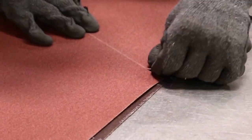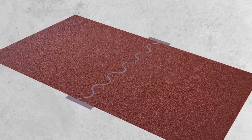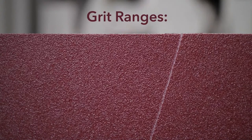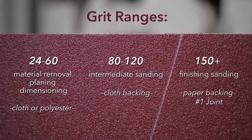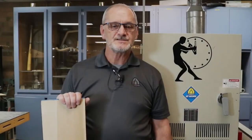In order for a belt to be created, both ends of the material have to be joined. Belt joints come in several different configurations useful for various applications. For more information on belt joints, watch our video on understanding abrasive belt joints. Grit ranges should be used as follows: grits 24 through 60 for material removal or dimensioning with cloth or polyester; grits 80 to 120 for intermediate sanding, usually with cloth; and grits 150 and up for finishing, best used with a paper backing and a number one joint.